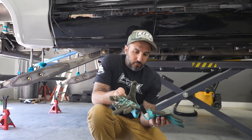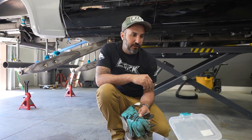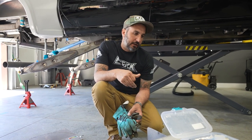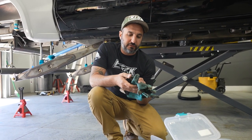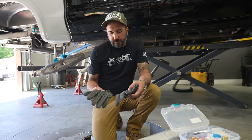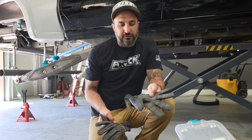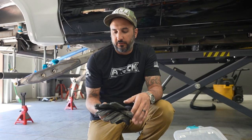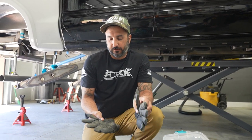You've seen me wear predominantly BMX gloves. A lot of this stuff, especially on sheet metal when you go to DA, leaves micro splinters everywhere. And something as simple as trying to wipe or prep a surface with alcohol or lacquer thinner, you'll get shards left and right. I was liking the precise feel but they don't offer much protection against heat. A lot of times I've got to hold stuff for Zach to tack in place, so that's why we ended up going with these — they've got decent heat coverage but you still have precise control and touch. They've been great for grinding. I've smoked them with the cutoff wheel a few times and never got any nicks. They definitely offer a great amount of protection for as thin as they are.